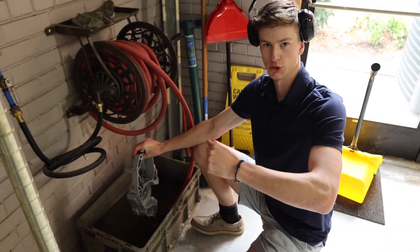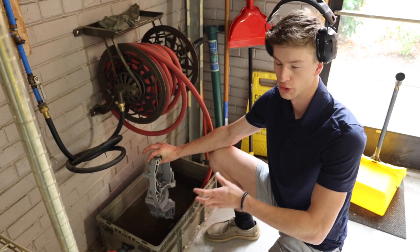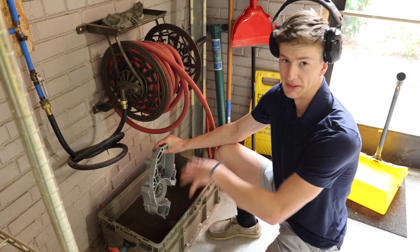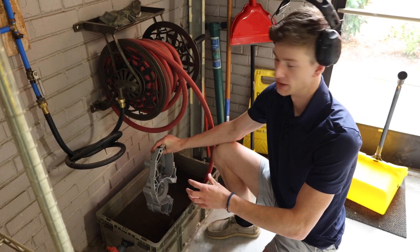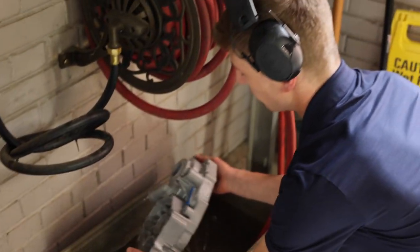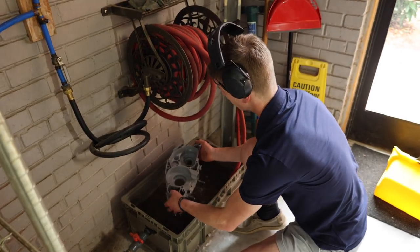You really need to put the part in a fresh water source or some kind of parts washer afterwards. We use ultrasonic tanks as well as vibratory tanks to get abrasive out of parts, but a dip tank is a super simple, easy way to do this at home — and it's just about as inexpensive as it gets. It's really good if you have parts with convex cavities, because the water will go in and get the abrasive out.